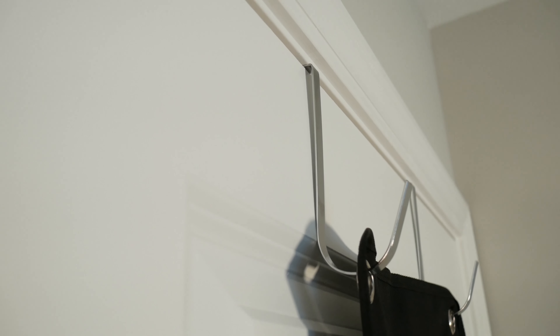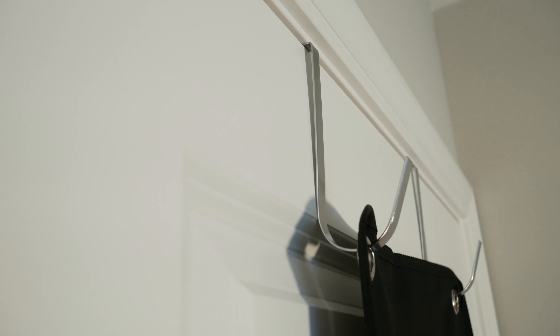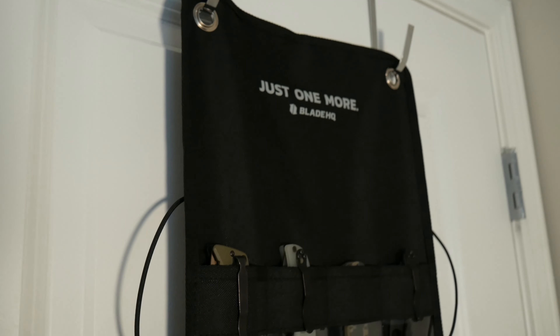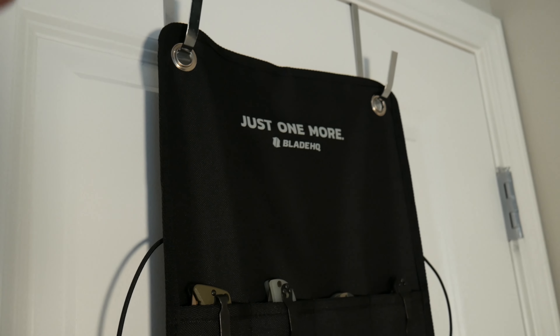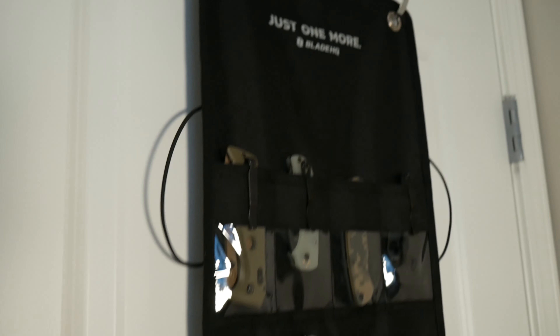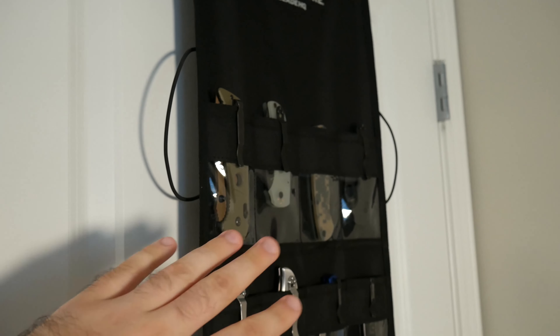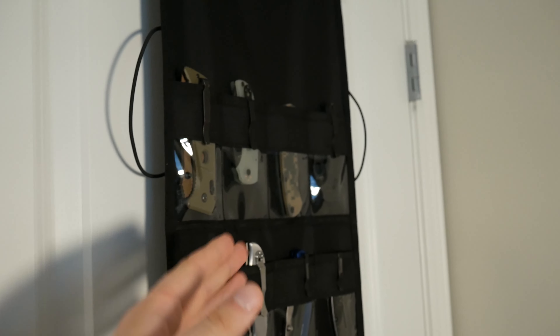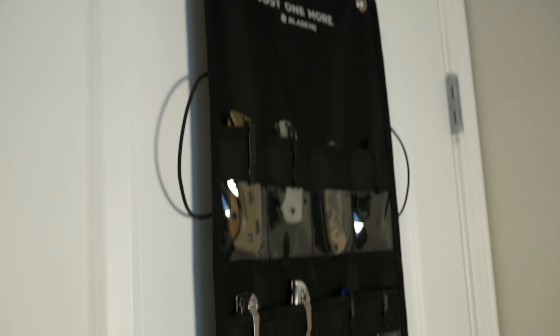You can see there's a slight gap, and what's happening is on the other side of the door, because of that gap and the weight coming down, it is slightly bending those prongs. If those prongs get super bent, it's not a big deal — I can just replace those — but it is something worth noting that it could get a little messed up if you have a lot of weight over time bending those out, especially when you open and shut the door. This thing will come out and slam against the door, especially if you really slam it. And over time, that is static weight versus dynamic weight — dynamic, moving weight is a lot more damaging than just straight static weight, because when you move away it creates greater force. So if you're doing it on a door where it's going to be moving a lot, that could be a problem.